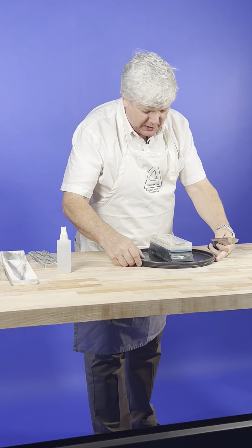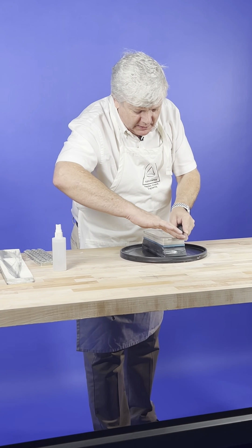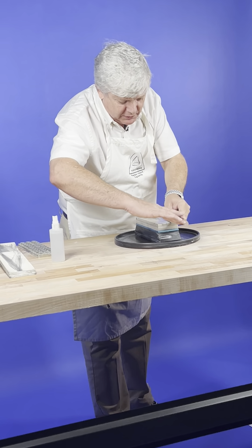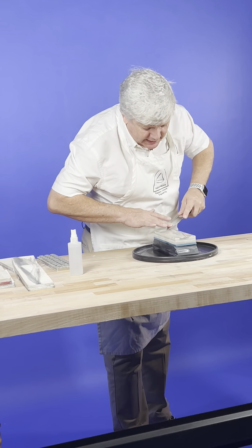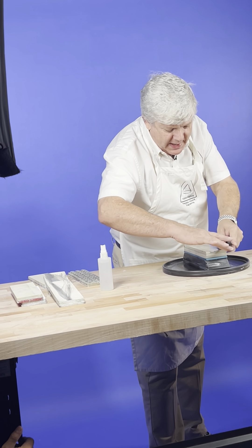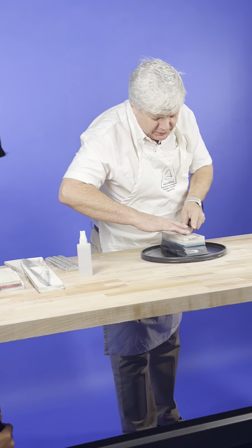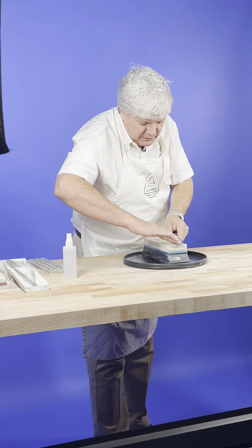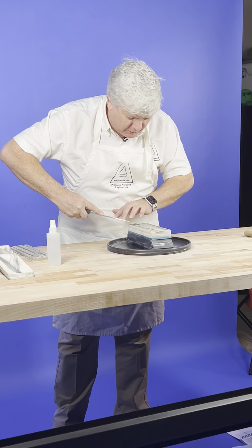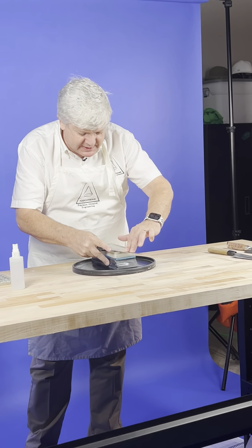Not quite all the way, but maybe I can move just a little closer to me. And there we go. Now I've got a nice balance. Tip to choil, choil to tip, just like that. And if you want to do trailing edge strokes, just circle back, circle back, and get a little curve in. So you're following the curve of the knife as you go around. Same on this side, following the curve of the knife as you go around. Got that finger down here just to check and make sure the angle is the same every time.